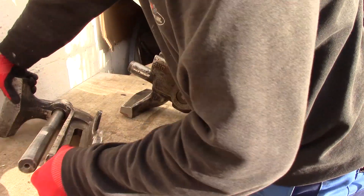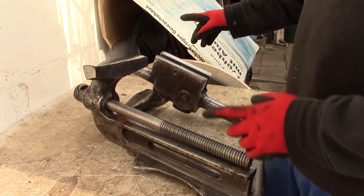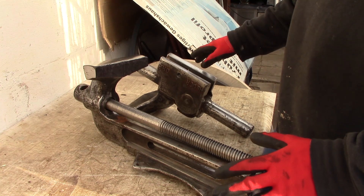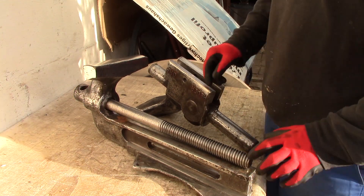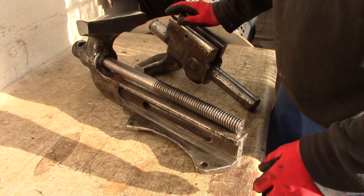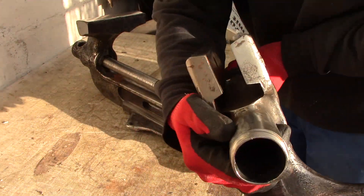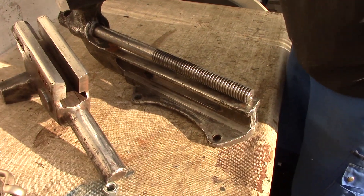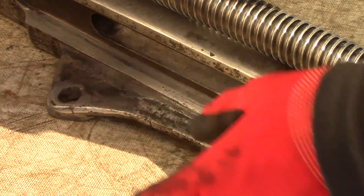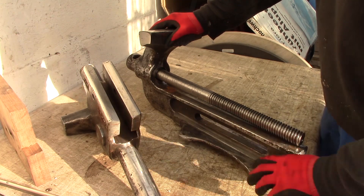This is a gauge that I put on - this was what I took off too much in the first attempt, so this is what I had to add back. Filing this is not easy and it's a lot of work, so maybe a shim repair is easier. But the results are very nice. It's a lot of work especially if you don't have a mill. If you have a mill this is probably much easier. But it works and if you have the time and the will to do it I recommend this repair. Also when you repair the slide you need to take off a little bit on the sides to make it nice and round, because since it was worn down it'll rub on the outside. You can see some rub marks on the surface. If you paint it, it'll just take the paint off. So take a little bit off, make it nice and round, and check if you have enough clearance.